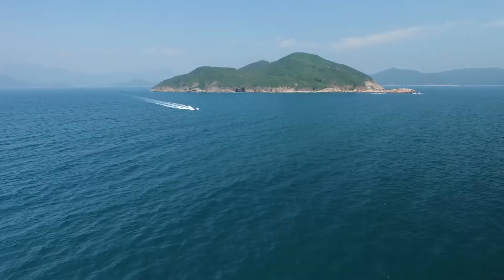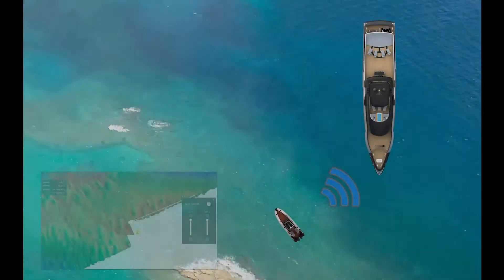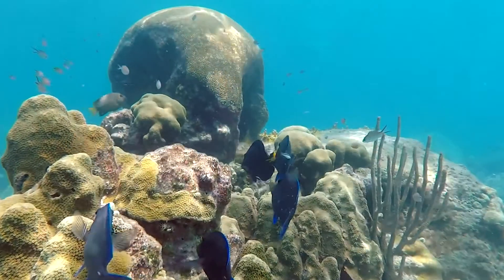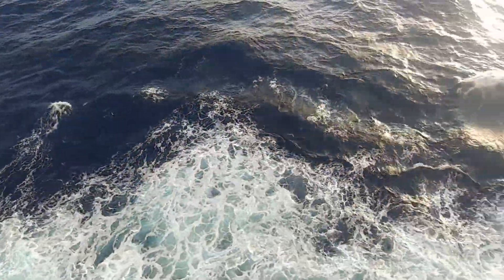The core point is to have a small, relatively expendable boat. There's a wireless link between a normal vessel and a small boat that can go into an area where you're not absolutely certain there's underkeel clearance — especially for a really big boat. That small boat needs a sonar system so you can survey the area and confirm there's underkeel clearance, identifying any coral or rocks not shown on the chart, making sure the big boat can enter safely.